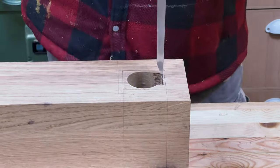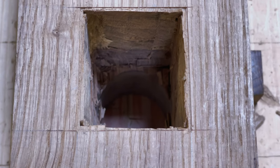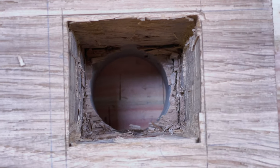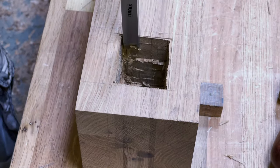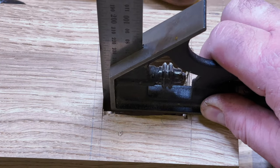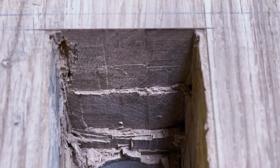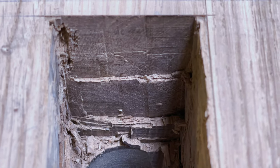Smashing out a mortise is pretty boring. All I'm doing here is smashing out the waste, getting close to where there's like 2-3 mil waste left. I'm not going to chisel all the way through to the other side. What's left of the 2-3 mil, I'll halve and halve again and use a combination square to check the walls are plumb and square. This gives me a flat face to reference the back of the chisel off of. I'll step the cuts like an open mine.